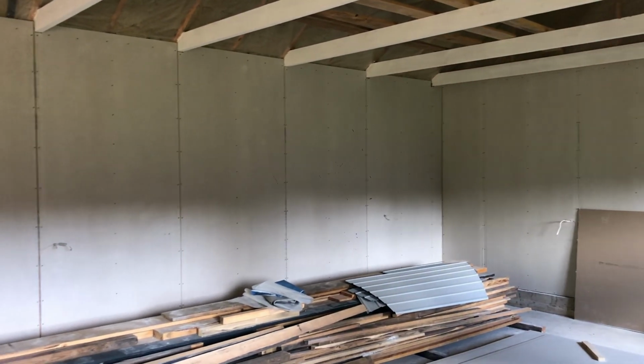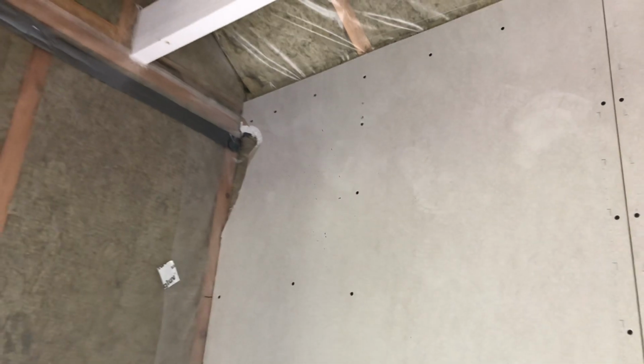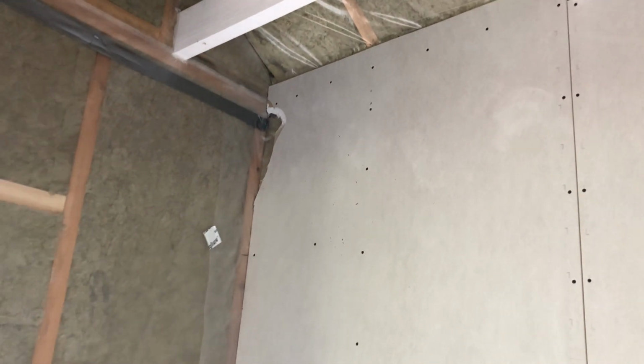The longest wall was finally installed. As I mentioned, there were some gaps, but that's not a big deal. What actually was a big deal was this corner, which broke while I was driving the last screw. I ripped out the broken piece completely and later had to cover it with mud multiple times. It turned out okay at the end, but some unplanned maintenance was needed.